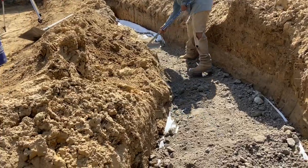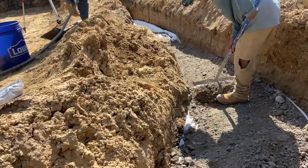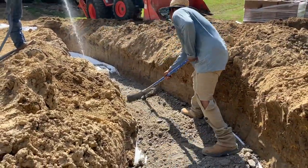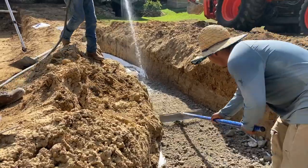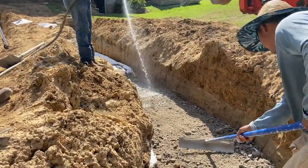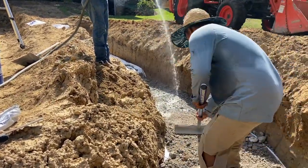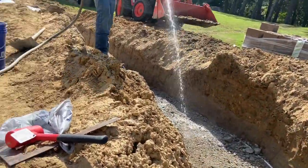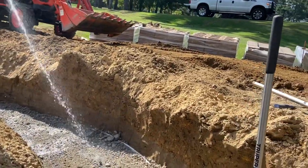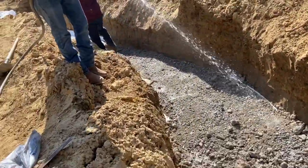Water will not sit on top of this layer. You can see I've got a plastic layer underneath — it's not truly plastic; it's a layer that water can go through, but it will not allow dirt to come up through the bottom of this base material. So you put that plastic material down first, then put in this base material, rake it down a couple inches deep, soak it down, pack it down, and you'll have a really good base for your rock retainer wall. This trench is 24 inches wide with a 12-inch wide block, so you've got six inches on each side.